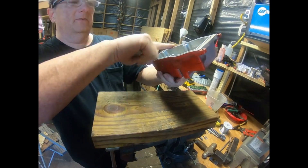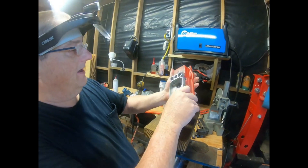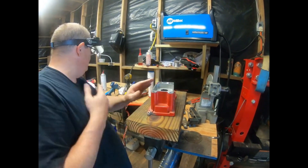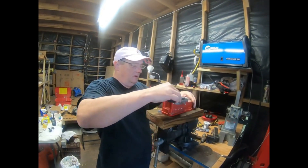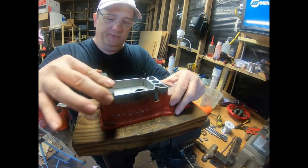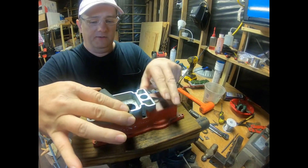Alright, so now we have the housing, the gasket is out, all our screws are out of the holes, and all our bearings are pulled out. The housing's not damaged, but I'll probably take a stone and go over this to make sure we didn't put any damage or dings in it. I'm gonna take a little sharpening stone and go over this thing to make sure it's nice and flat so that it seals to the top of the turbo — we didn't ding it, but we're going to go over it to make sure there are no high spots.